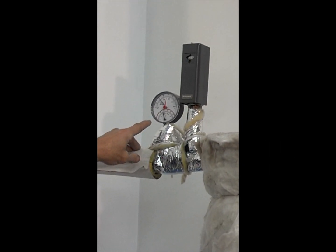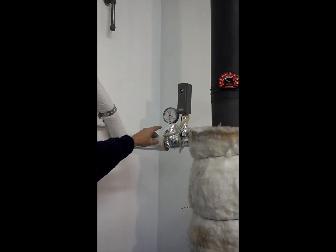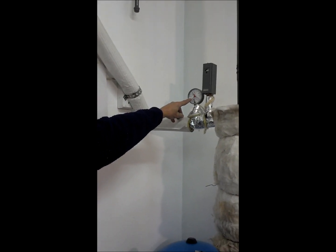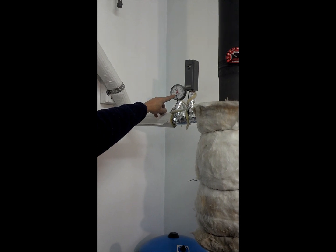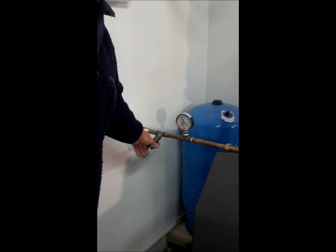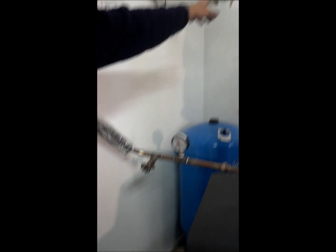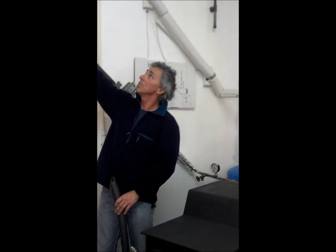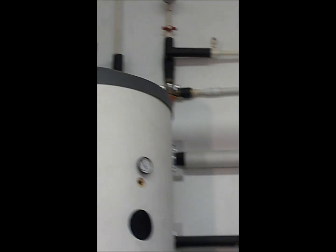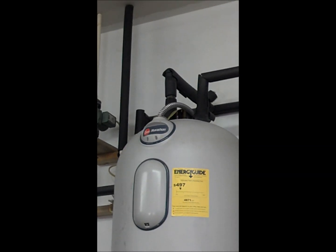Right now, I fired this up about an hour ago — it's April, so we don't need much heat in New Hampshire. I fired it up just for the video. The water is going out at 150 degrees — excuse me, that's the pressure. I'm running about 20 pounds pressure; I start with zero in the system, and right now it's up to about 20 pounds. The circulator is on via the aquastat, and the water is going out at 120 degrees; on the return it's coming back in at about 110. To fill the system I use a boiler drain. On the hot water feed-out line at the top, behind these tanks, I've got two T's: the first is tall and capped and I use that as an expansion piece, and just beyond that is another T with a normal hot water tank pressure blow-off valve.